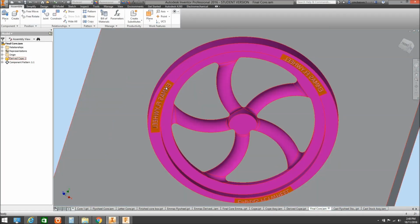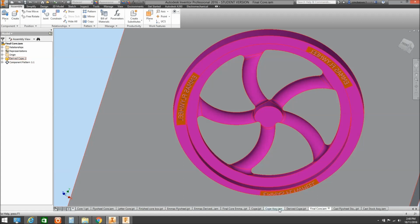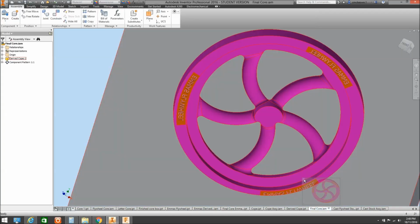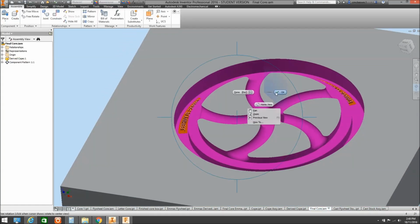And then we would insert those little cores. So these little cores, we'd make up 3 of those. And we would put them into the prints that have been left in the sand. So that's our box ready to cast.